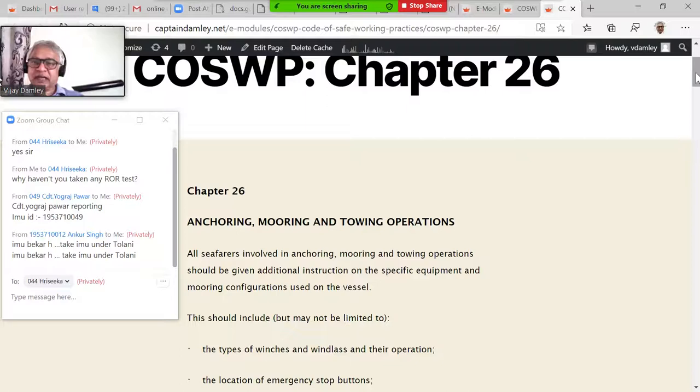So at the hawse pipe, we clear the guard which is closing it. And now the chain is clear in the hawse pipe where it is connected to the anchor. You can actually see the crown of the anchor there, the head of the anchor, where there is a shackle. And when we have done these two things, then we open the securings on the anchor. Those are called anchor lashings, where we sometimes have to use lubricants and all, because what happens, you had bad weather, you were using some turnbuckles which may get corroded and it becomes a little difficult. So you have to use some lubricant so that it moves easily, and we open them.